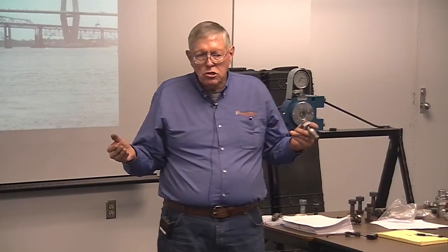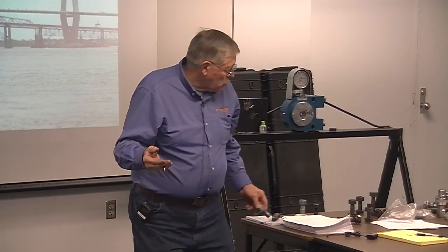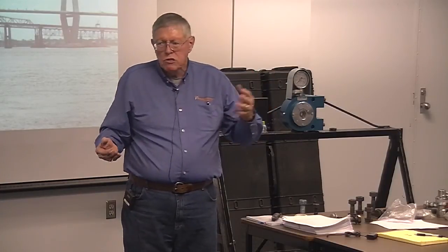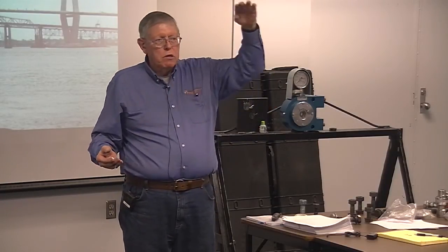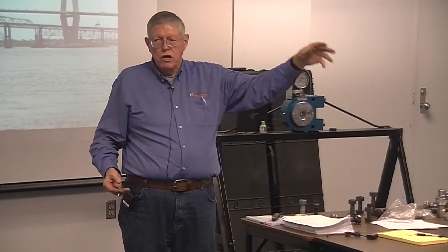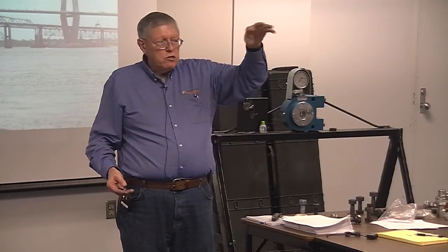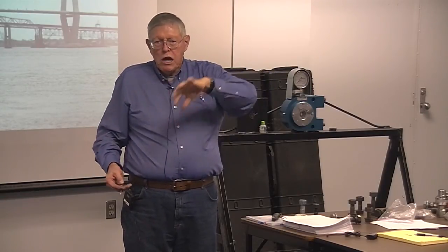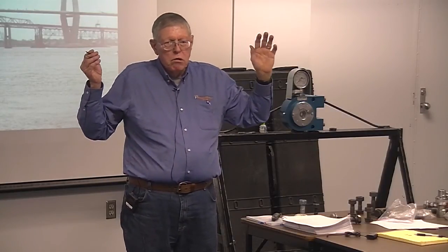That's not too much tension. Leave the rest in there, but verify that you're not at 70 kips or 67 kips or way up over. You're good as long as you're on this side of the curve. When you start dropping down, you shouldn't be over here. We're plateauing around 60 kips on a 7/8 inch bolt. If you're on the uphill side, you're okay.